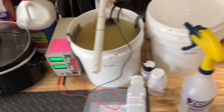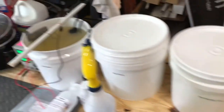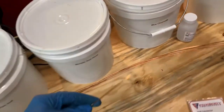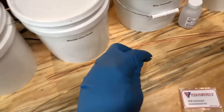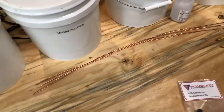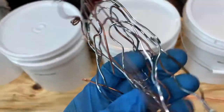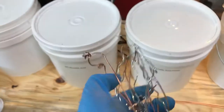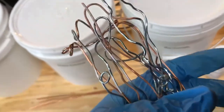While waiting, I'll mention the copper wire I use to hang pieces - just cut off strands about two feet long from regular Romex electrical wire and stripped. After you use them a couple of times, once they get heavy coatings of zinc and blue chromate, I'll retire those pieces and recycle them.